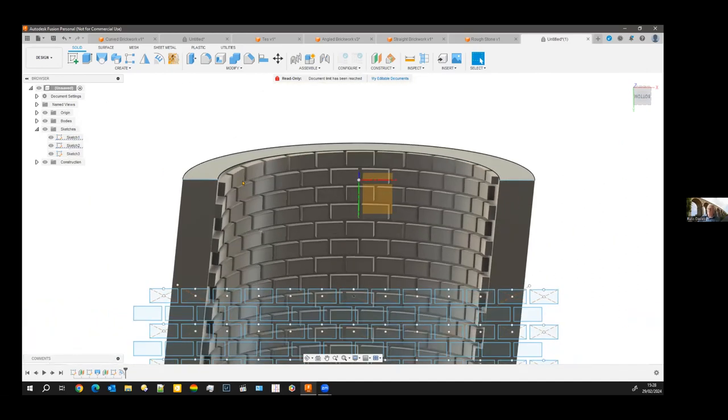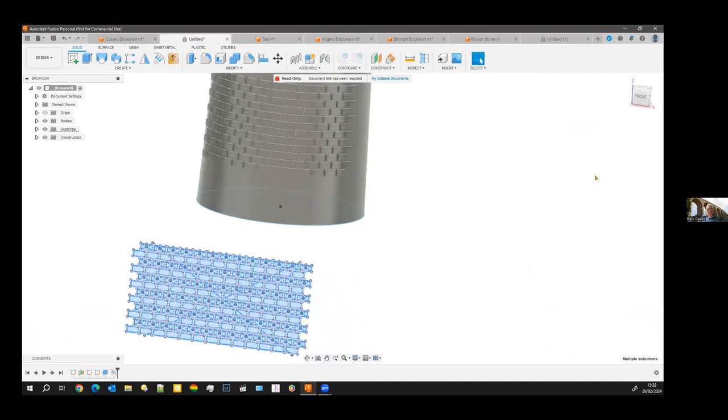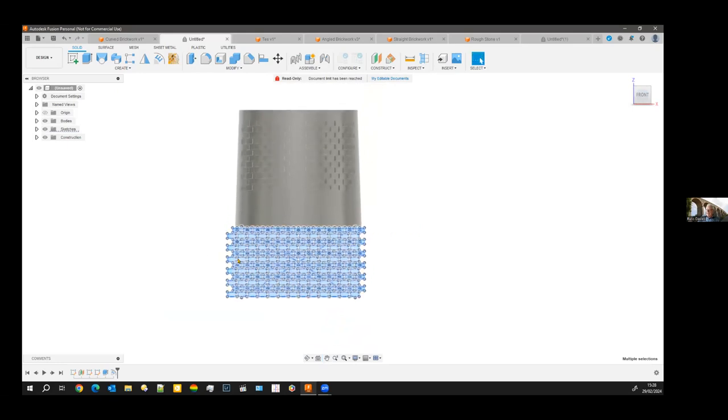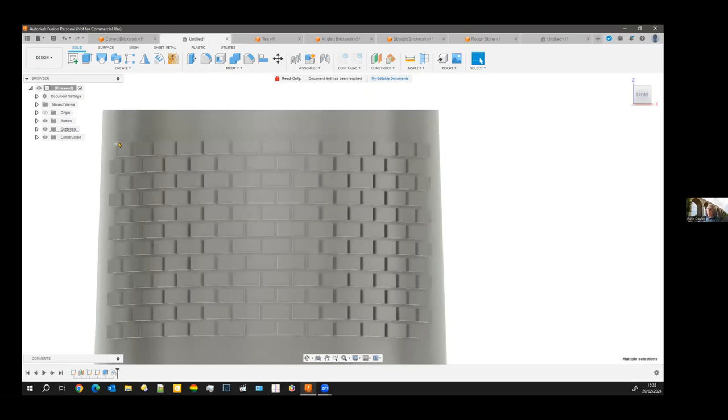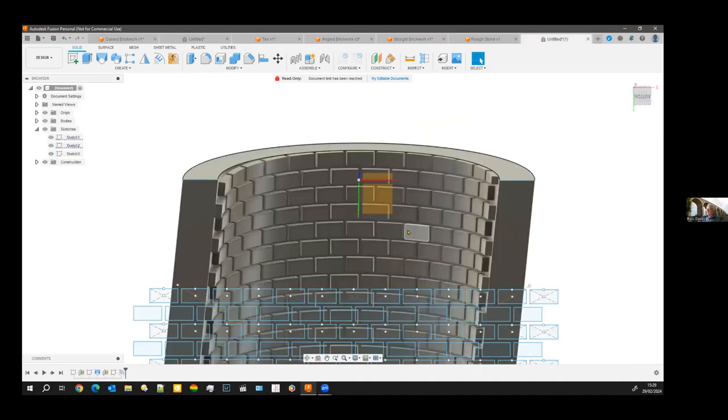And the easiest way of explaining that to you is to go back to this one, which is a chimney that's been put on it, you know, the bricks on a tapered chimney. And if you look at it, when you wrap a band of ribbon around a taper, it will not join up with itself when you've gone right round. It winds itself up the taper. And you can see this here by the gap between there and there compared with in the middle. You can't wind a strip round a tapered cylinder and have both ends meet. And that's the problem with the skewed arch, as it were. And you can see it there.